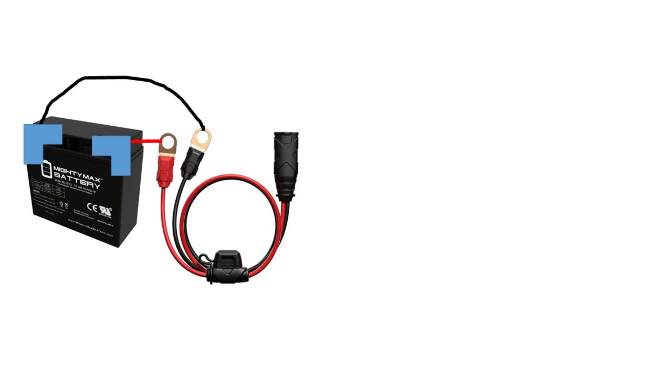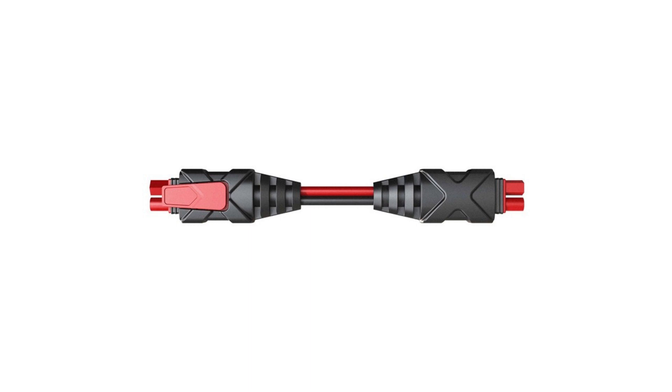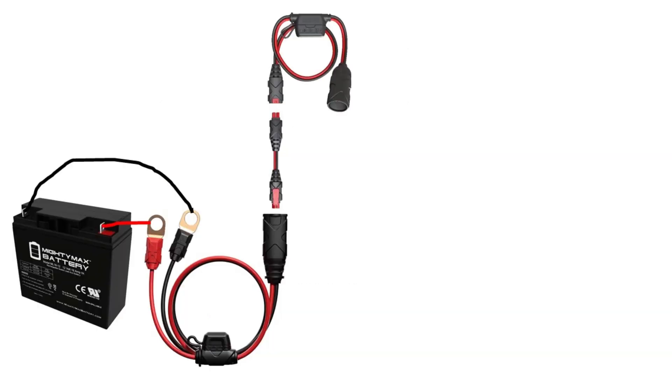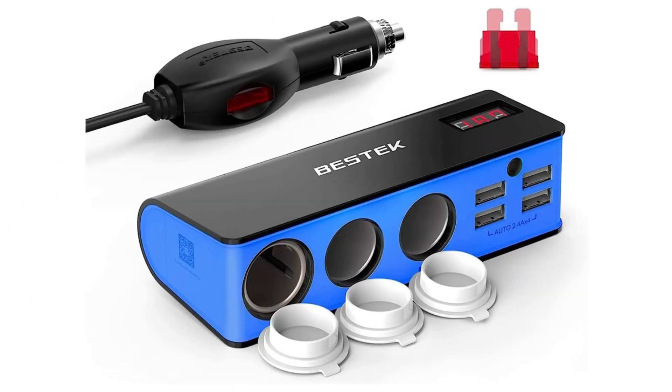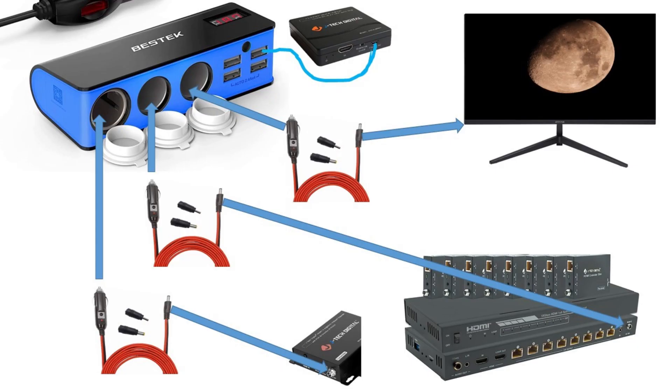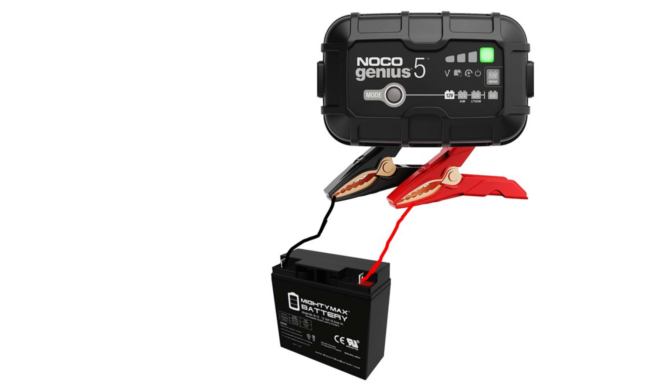The design of the NOCO connectors makes it virtually impossible for them to short, which is why I like to use this brand for battery connections. Next we need a NOCO male-to-male coupler, which plugs into the harness, and a NOCO female socket 12-volt plug accessory. With all these cables connected, we can plug in a 3-socket 12-volt adapter with USB ports. We'll also need some DC car charger 12-volt cables to power the extender and monitor. That's the reason I selected this specific monitor — it requires a 12-volt input, unlike most monitors which require 19V or 120V AC. A charger with alligator clips can be used to charge the battery.